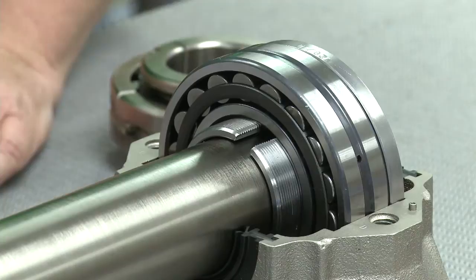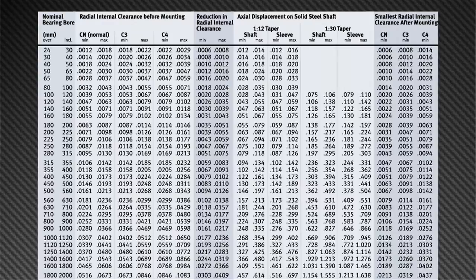If we have two fixed rings, we're probably in a rough situation. Starting here, we want to make sure that once complete the bearing is centered in the housing and the two locating rings fit on both sides. First, we'll need to determine where the center line of the bearing will be. Then you can install the threaded adapter sleeves onto the shaft and place the bearing in its resting position on the sleeve.